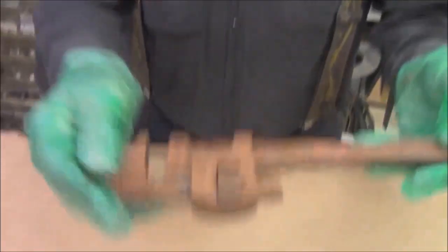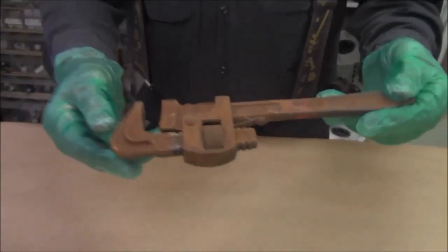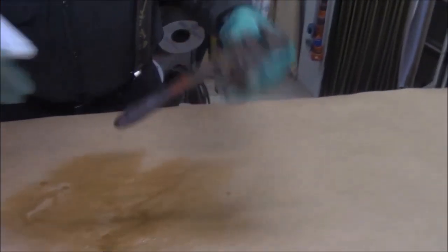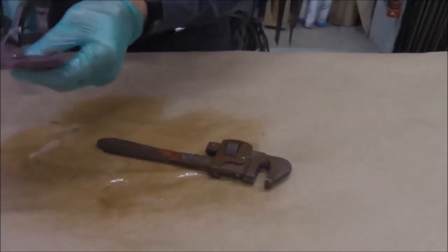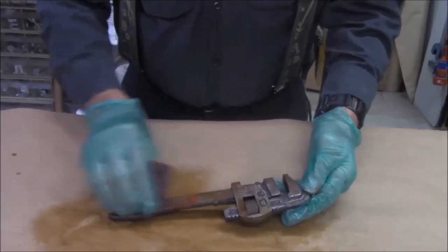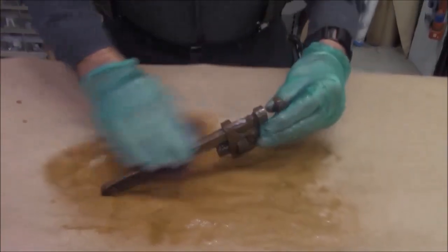So now we have a small tool — my grandpa's old pipe wrench, same thing, just covered with rust. She's not looking so good, been laying in the water a little too long. Another phosphoric acid-based product — this is a Crud Cutter product, and it comes in aerosol, liquids, and other forms. We're going to use the spray because it's handy when trying to do something with cracks and crevices, or when I want to do a quick job. You can smell the phosphoric acid — you want to make sure you're using this in a ventilated area. You wouldn't want to be doing this with your head down in the laundry tub. So I'm going to let the rust set — I'm a little early yet — and let this dissolve. The beauty of this product is it acts as an inhibitor for up to a whole year.